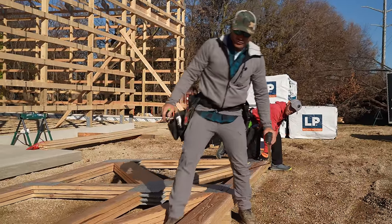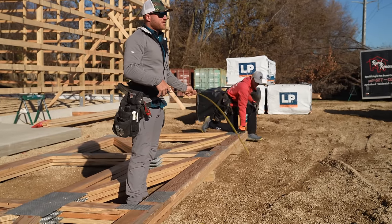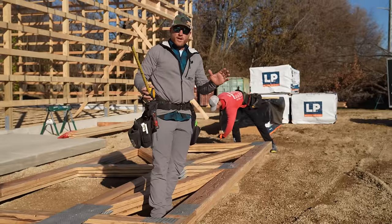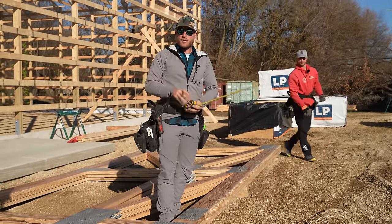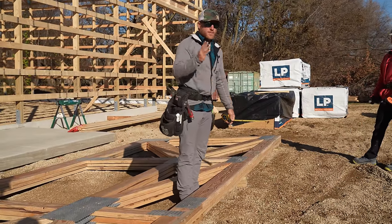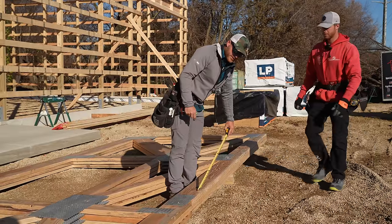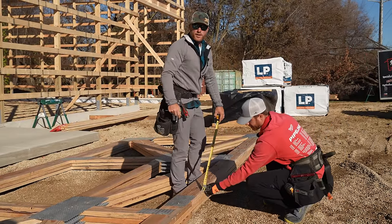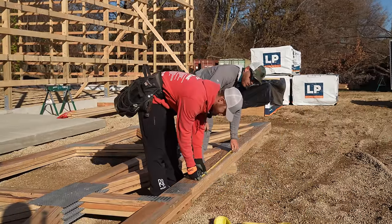We're doing a 2 foot truss system here. We're a little bit weird. We don't have an exact even footage building here. So we got a little bit of a weird layout in a sense that it'll work on one side of our roof line with the dormer. The other side is gonna have some weird framing. It's not gonna be 2 foot on center everywhere. Greg, you wanna hold me on this guy right here and I'll finish this 2 foot on center layout. And then I think we'll be able to throw this and then hopefully it'll make sense as we install this. You guys will see what I'm talking about.